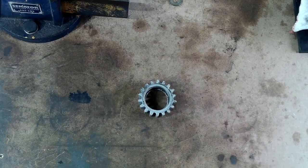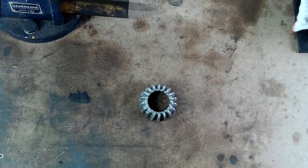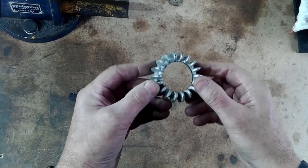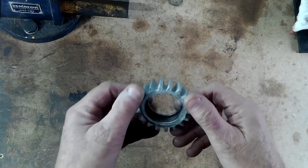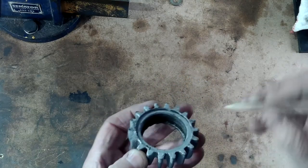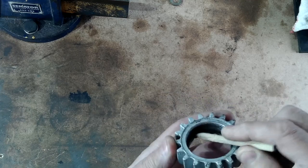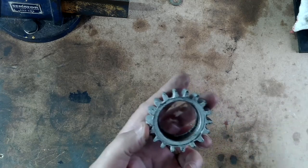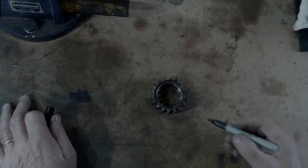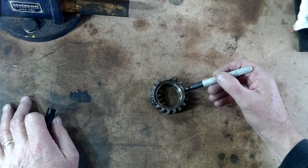This video is about a modification I was asked to make to an exhaust collar from a Villiers two-stroke engine. It's a cast steel component with fins that I believe are not only there to aid some sort of cooling but to provide a substantial amount of purchase towards holding the manifold pipe in place. There is however a problem with this, in that the collar does have a tendency to come undone and for the exhaust to fall off.